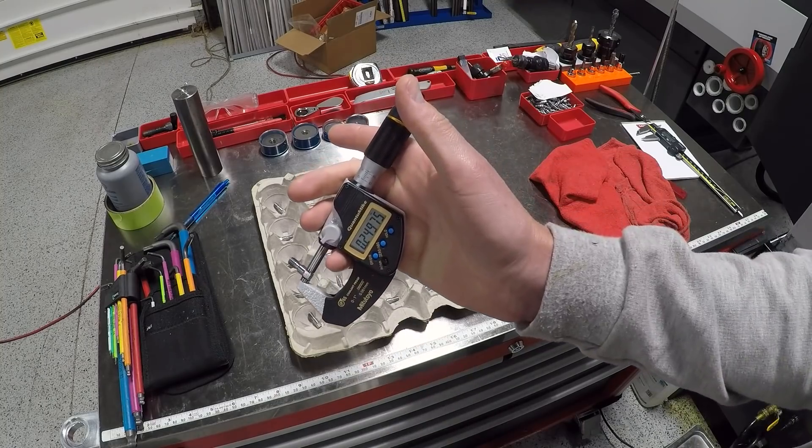I've got good news and bad news. The good news is it's really only one thing, but the bad news is that one thing is thermal control. To be clear, yes, there are absolutely other factors that come into accuracy and repeatability. Those things can range from work holding to tool pressure to the cutting insert, tool wear, tail whip in your bar stock. While those factors are all real, they're also the sort of things that once you figure them out they tend to be pretty good. Whereas the whole element of thermal growth, thermal expansion, and how heat affects the whole machine tool and the casting in your parts is a little bit trickier.